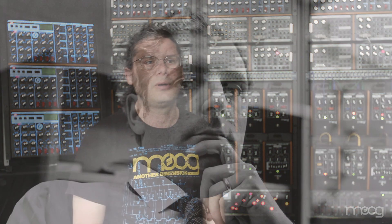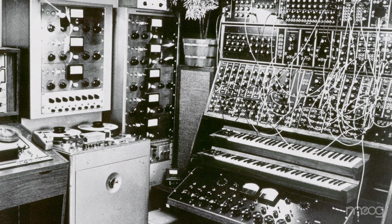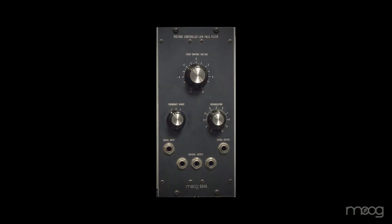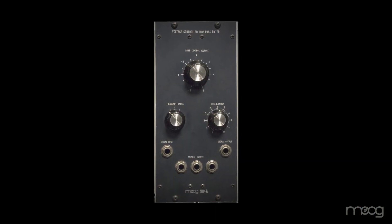There's really nothing else that sounds like a ladder filter. It has so many characteristics that are very musical and work well. There really still to this day is no other simple, elegant, good sounding way to create the sound. Bob had to solve a lot of problems that hadn't been solved before in designing early synthesizers. He needed a filter that was voltage controllable — because we had to be able to change the sound based on parameters, whether it was the envelope of the sound or a particular frequency. It's really the heart of subtractive synthesis, which is the Moog sound.